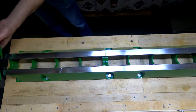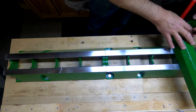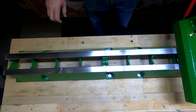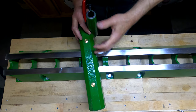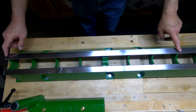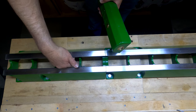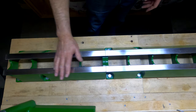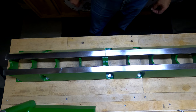Now I'll put this back on. That is just beautiful. I'm not going to bother at the moment with the tailstock, but I am going to do one more thing to make this a little better. More than one woodturner has said this is a bad idea, but I'm going to wax this. When the banjo is tightened up, it literally pulls up against the bottom in here, and that's what tightens it. While the wax will make things slide more easily, I don't think it's going to interfere with the banjo once it's locked. So I'll get the wax out, put that on here and see what that does.